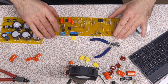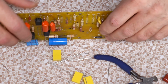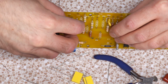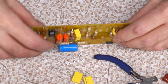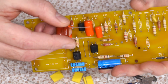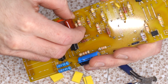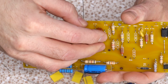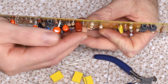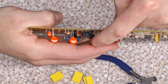Well, we might have our capacitor choice made real easy for us right now. Because if we take these blocky caps and I try to put it in there, the resistors that we got are too fat and she don't fit nice. So indeed, these guys also being 1U, they're 250 volts, but that should be fine. We'll be able to situate those guys a little bit more favorably. You know, we can hover them up a bit, like I'm doing with the other caps that are too thick to fit down against the board, you can see.